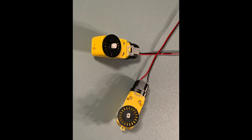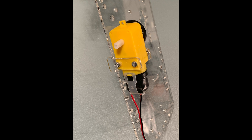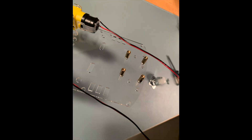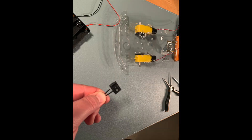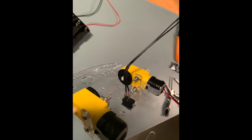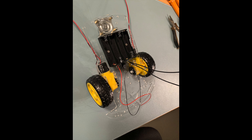Finally, I installed an encoder disc on each motor. Now it's time to attach the motors to the chassis, and this is pretty straightforward. Just use two motor mounts, screws and nuts to attach each motor. Installing the caster wheel starts by attaching the standoffs to the chassis, then the wheel to the standoffs. For the power supply, I simply cut my own wire and attach it to both terminals. Then I snapped the switch into place on the chassis. And finally, use the two flathead screws and two nuts to attach the battery pack to the chassis.